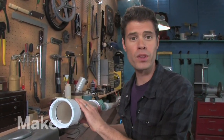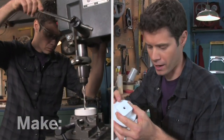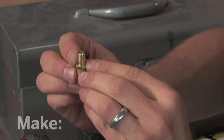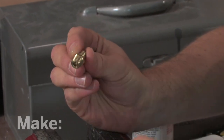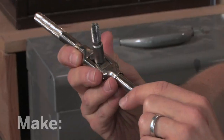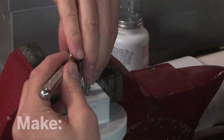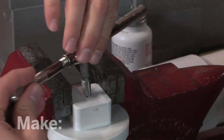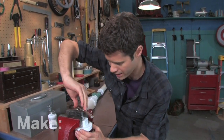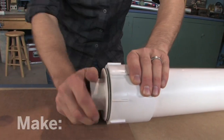Now I need a way to fill this tank with compressed air. The way to do that is take the end cap — I've drilled a little hole in there. I'll clamp this into my vise and add a tank valve. This is kind of like a bicycle valve, only it has threading on the end. So to put threading in that hole, I get to use my favorite tool, the tap wrench. This allows you to put perfect threads into a hole. I'll line this up carefully and screw it in until I've got perfect threading. I've threaded the tank valve on using some pipe compound, and I've also placed some on the end cap, so I'm going to tighten this down.